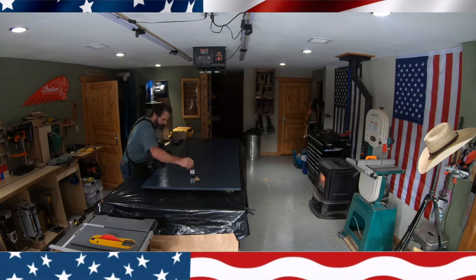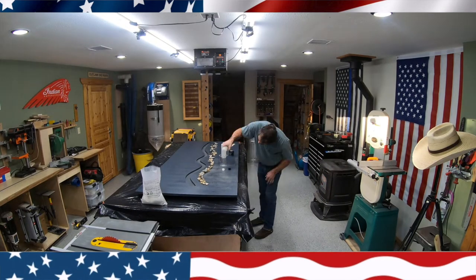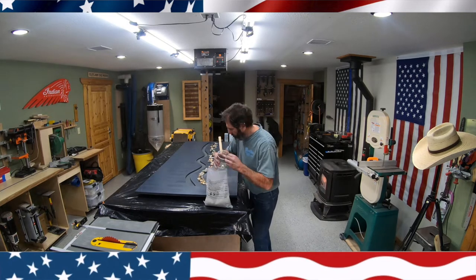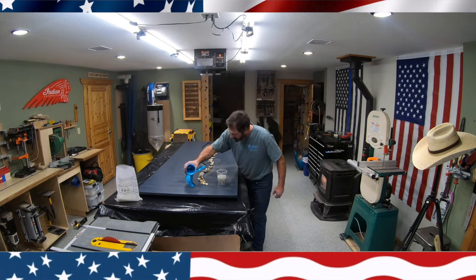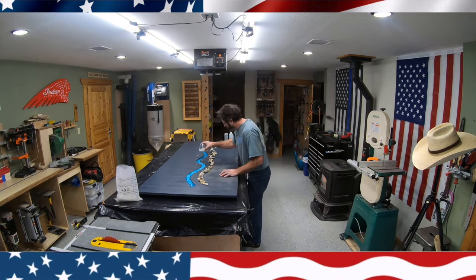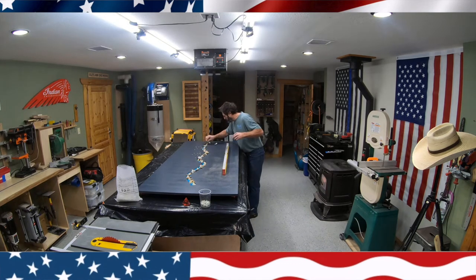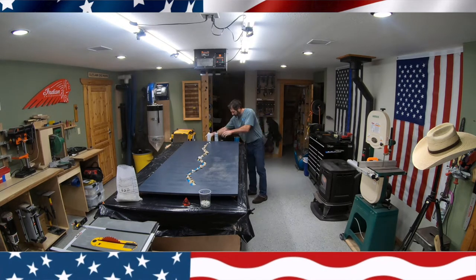That way I'll have some good blending and should get good contrast in the epoxy with cells and different things. Right here the paint is all dry and I'm mixing up some epoxy to fill up this river using a blue from Eye Candy — Okinawa blue. I had bought these rocks hoping they would fill the whole thing, so I make sure the table is level and fill in the epoxy with little beach rocks. Then I realized those weren't really enough so I got some glass and seashells and added those to the river.